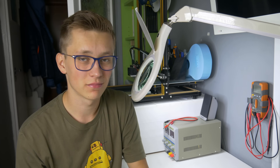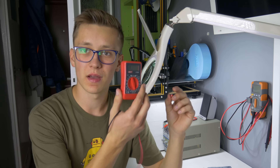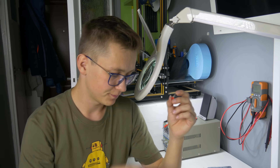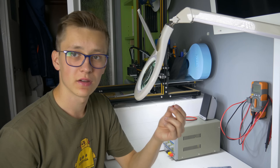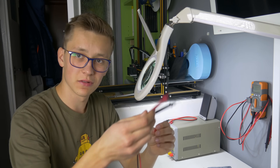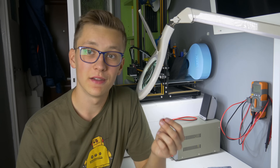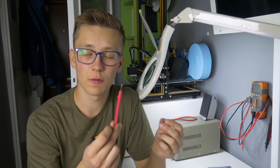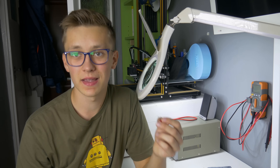With these three simple methods you can always say which lead is negative and which lead is positive. But I have still two more, just for your curiosity. Here I have a multimeter — a very simple and cheap one. It can measure diodes, as you can see. To check the polarity of an LED, all you have to do is take the probes and touch the leads of your LED with them. If the LED lights up, it means that the lead touched by the red probe is positive and the other one is negative.